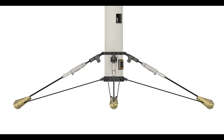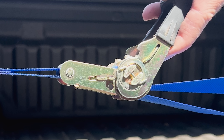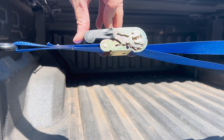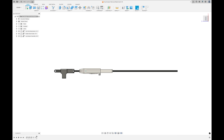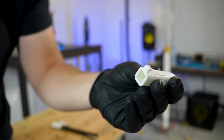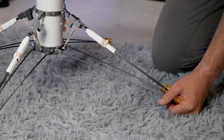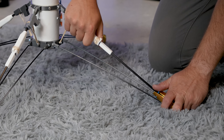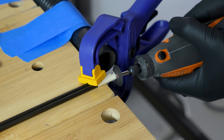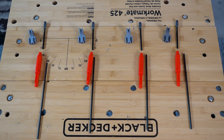The plan was to have the top strut compress against the spring, but I needed it not to be able to spring back. So for design inspiration, I turned to a ratchet strap. As you pull the handle to tension it up, there are teeth that slide across the locking mechanism, thereby storing the tension of the strap. The only way to reset it is to disengage that locking mechanism. I designed an outer body with a locking clip that slides over an inner body with teeth while compressing a spring. The parts fit together in a square peg so they can't rotate, and I put a rubber band around the outer piece to help that clip stay snug against the teeth. To reset the legs, all I'd have to do is pull back that clip. These parts were made using my 3D printer and PLA filament, and I used 5mm carbon fiber rods for the top strut, friction fit to both pieces without any epoxy, so outer parts can be quickly replaced and other components reused.